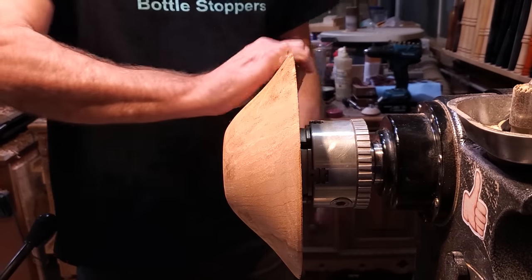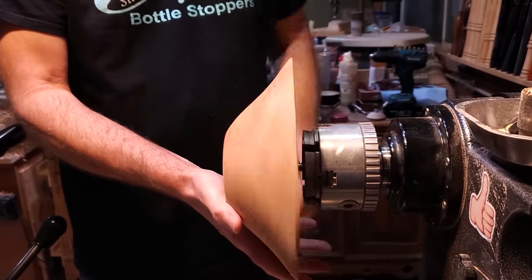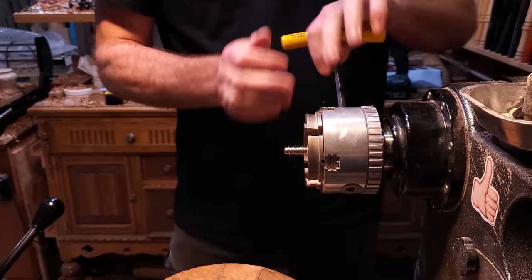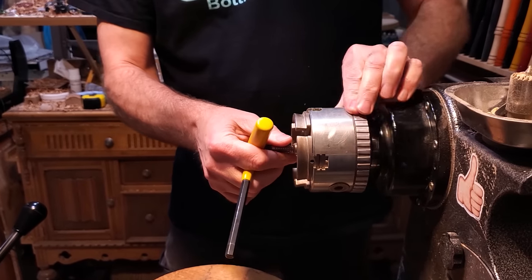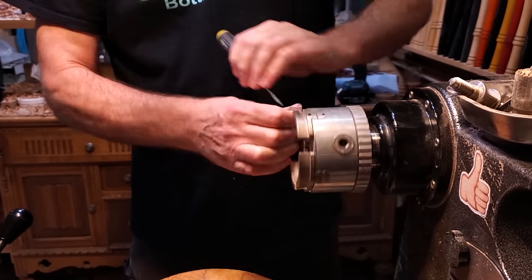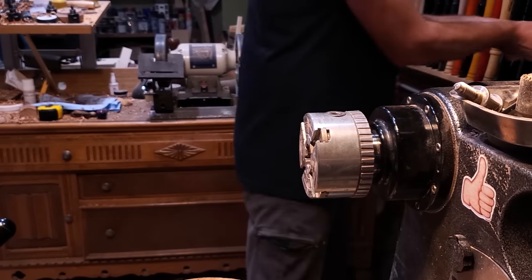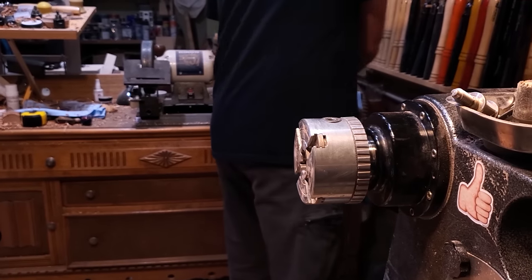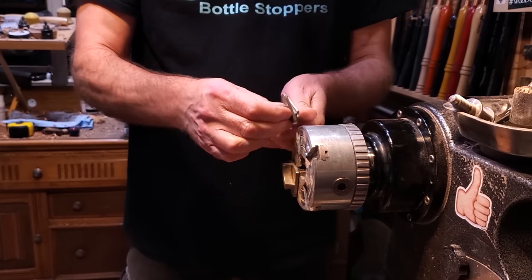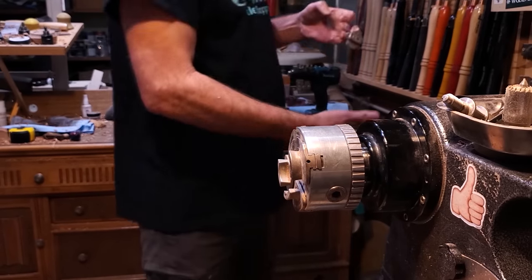So I went ahead and made a recess just like I was going to do if I was going to finish it. And the problem with leaving it punky like this and finishing the whole piece is, even if I would have sanded the outside of it, when I go to turn the inside of it, you can't sand out all those little, it's literally just kind of ripping the grain out. So it goes in so deep, you wouldn't get a decent wall thickness. It would be uneven, and it's kind of flaking off on the top of it too. So I'm probably gonna throw this piece in the fireplace, even around the edge of it too. You can see some of the pieces that just kind of fell off of it.